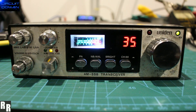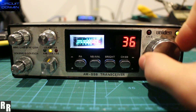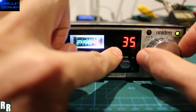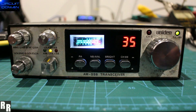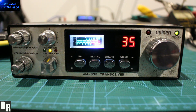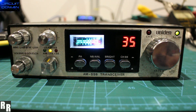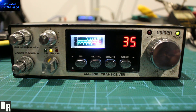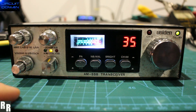Here we've got an update for version 2.6 for Digimax Lite, which includes the new 5KC option. You can see a little dot on the left-hand side which depicts when it's on the zero frequencies. It's paired up at the moment with an RR824 to 106 PLL adapter board and this AX144, which will work just the same with the RR719 to 106 — that's all those Uniden and Grants, 148s, Washingtons, et cetera. This kit will also support the UPD858, and PLL02As are coming soon.